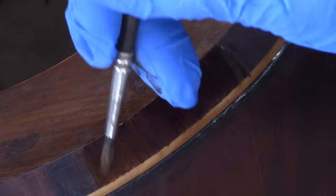All right, I'm going to let this coat dry overnight, and my touch-ups are still light. I think I'll probably tone them with a little aerosol tomorrow. All right, it's not looking bad, but when I padded it, I did take off some of the color on my touch-up, so I should have sealed it with aerosol first. But what I'm going to do now is use aerosols to get my final color on my touch-ups.